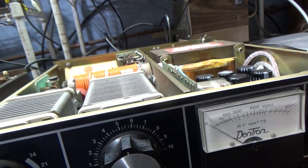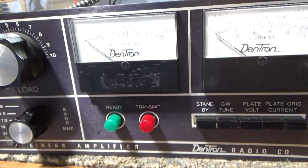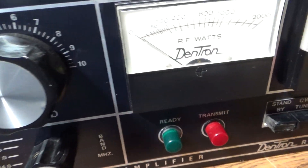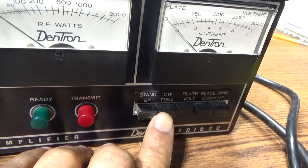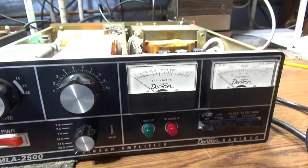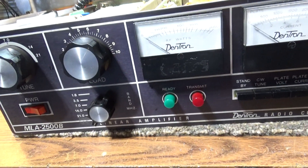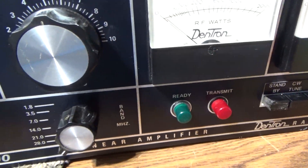So the main difference: the B has two taps — about 1800V on low and 2300V on high. One of the crazy things I found with this non-B unit is it doesn't fully match its own schematic either — it actually has the two-tap transformer and changes voltage on CW and SSB, just like the B, even though it has only one diode. Dentron apparently changed production runs, so this one is kind of half MLA2500 and half B.